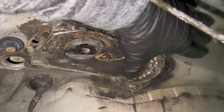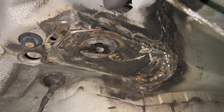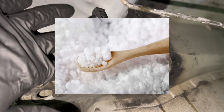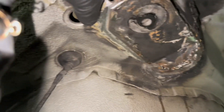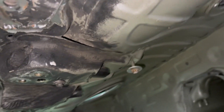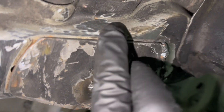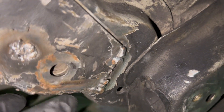This time I'll be cleaning up the welds, spraying them with rust primer, painting them, and then putting some silicone on. As far as the cracking goes, I'm honestly extremely impressed. I saw videos mentioning epoxy and was skeptical, and last time I was too scared to remove the gas tank, so we only welded most of them halfway. But I'm getting zero new problems — there's one crack where the gas tank blocked access but it hasn't spread. I think epoxy would probably work fine too.